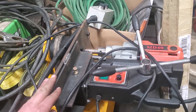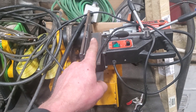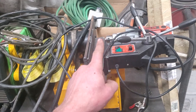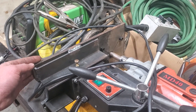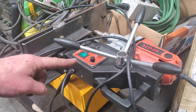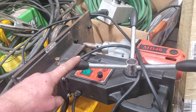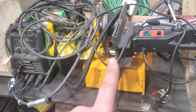If you notice, it has a mag drill mounted on top of it. The reason it has a mag drill mounted on top is there's a DC inverter in here — this originally had a DC motor on top of it. The inverter went out and I could not get the inverter for the variable speed drive to work on a job site, so I had to configure another way to do it. I made a mounting plate, made a drive shaft, mounted an MD-40 — another Amazon purchase — and this has a 24 to 1 gear reduction, which gives this drill plenty of power to turn my 1.972 boring bar.